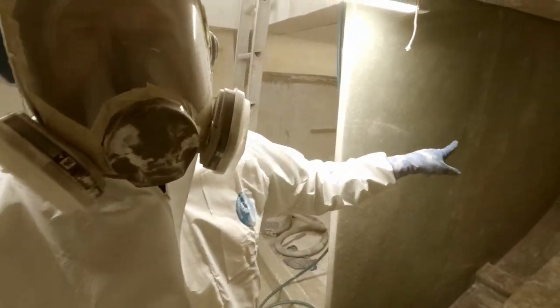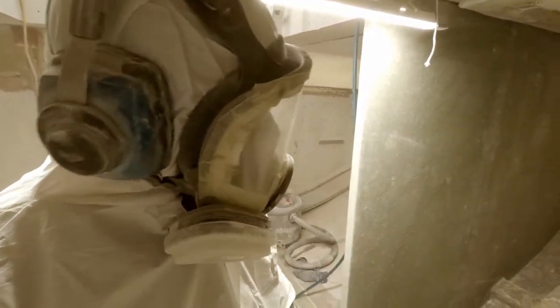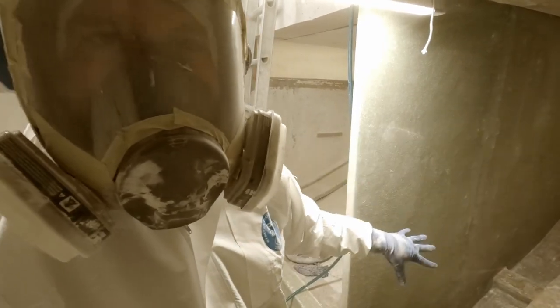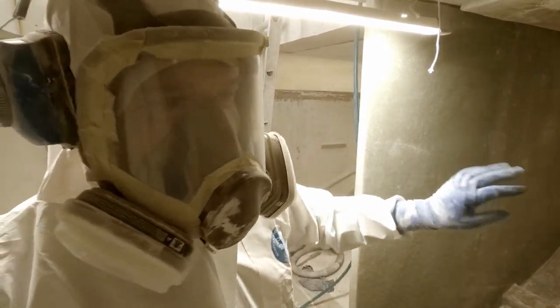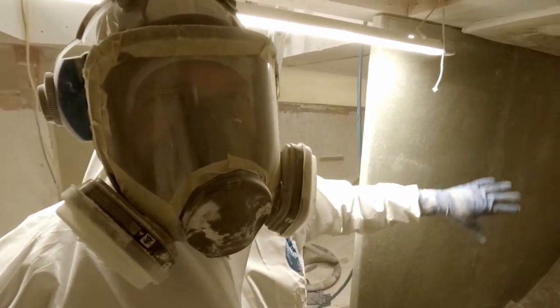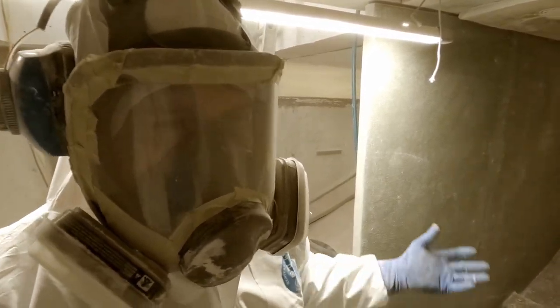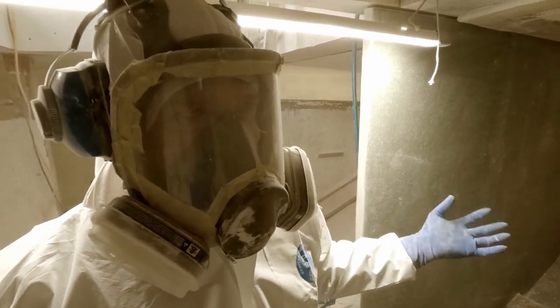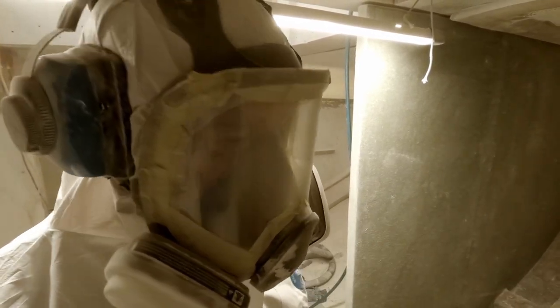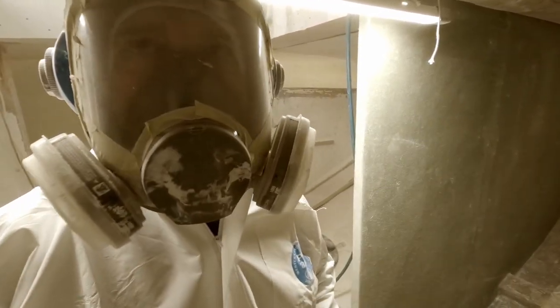Yeah. So we're just kind of doing the final prep here to start tabbing this bulkhead into the hull. Got a little bit of cleanup to do, some spots where some putty was sticking up and sharp. Just try and screw those edges off and blend them so when we lay our fabric down, it goes down nice without floating. No air pockets or big puddles of resin in there anywhere. So I think we're pretty much ready to just wipe everything down and start laminating.